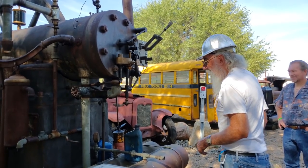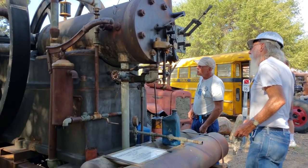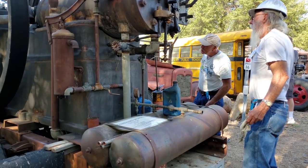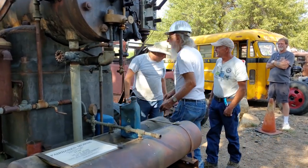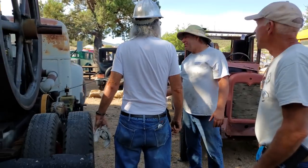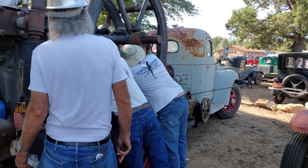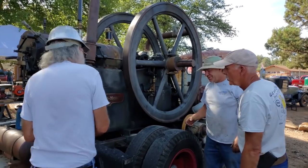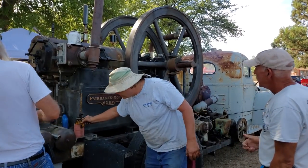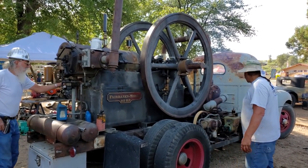I get a little gas out of that valve, and that gives me some priming gas to actually start the engine with. There's a cotter pin that operates a sliding mechanism to allow you to hand pump things. I go around to check that Ethan got the cotter pin in the right place — and he didn't. One of those things you learn after many years of doing this. Once the cotter pin is back in, you put a little more oil in the cup on the fuel pump — it's just a brass piston and brass sleeve with packing and check valves. Very basic fuel system.